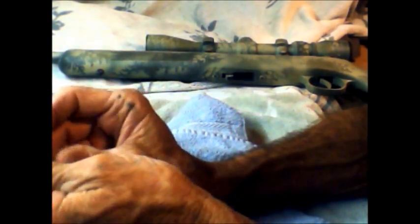But rounding off that ramp, rounding off the inside of the 2 V cuts, again, don't mess with the gap between these 2 faces on the top. That's what holds the cartridge until it reaches that cut. But anyway, rounding off those inside edges, rounding off the ramp, play with the spring if you want to, just makes this a lot easier magazine to use.